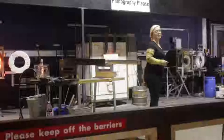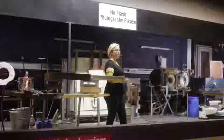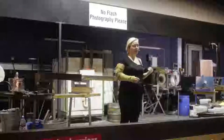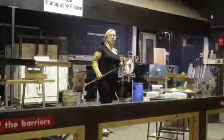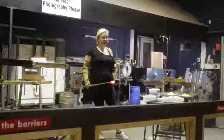This big white box here in the centre houses clear molten glass. What we do is add different thin skins of highly concentrated coloured glass to the clear to create all the different effects. To start, the blowing irons are preheating over here. This is just a hollow stainless steel tube that you breathe down into the glass. I've started by preheating the business end of the metal — it's only when the metal is glowing a dull orange colour that it's hot enough before the glass is dipped.